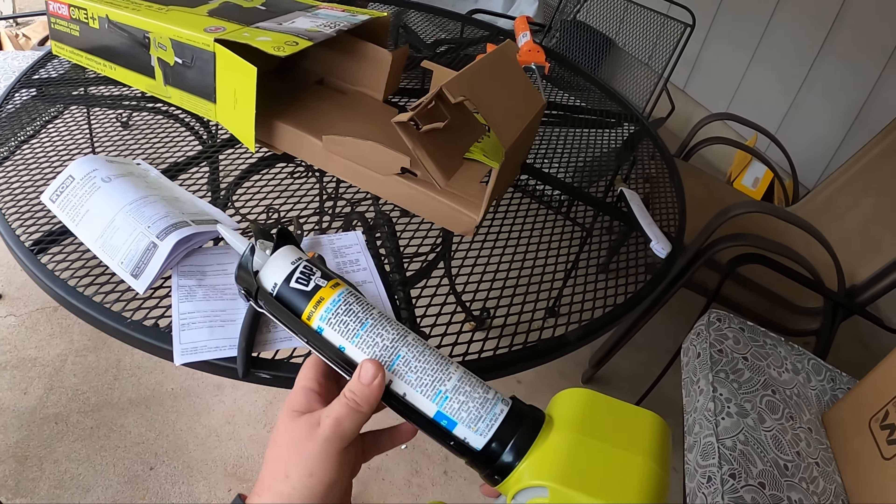Overall I'd say go with the dripless. And of course, as with any caulk gun no matter what you do, you're eventually going to get some type of leakage in the back. You can actually see this in the big gun here too — some leakage accumulated on the back pusher. I just can't emphasize enough that it's important to make sure you pierce the seal if it needs to be pierced, otherwise you could end up with a huge mess inside. I've read reports of people having their caulk go all inside the machine.